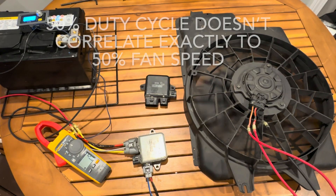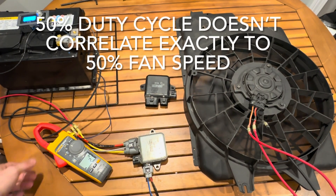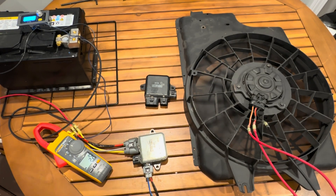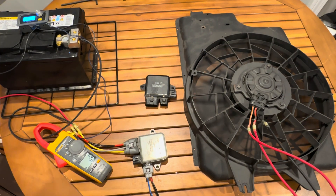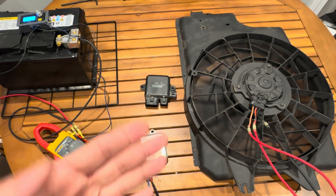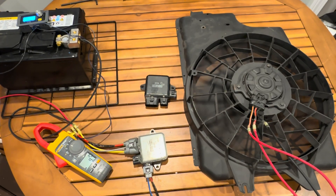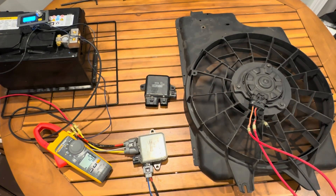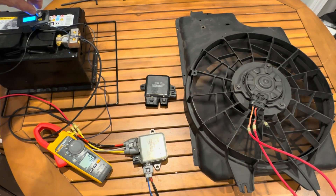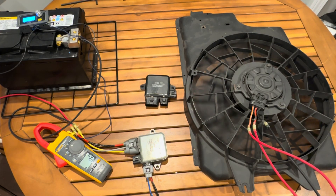As we go beyond 20%, we're drawing about half an amp — that's the lowest possible speed. I'm going to run it up to 50%. You can see the fan slowly increases speed and the amps climb to around 2 amps, stabilizing at about 2.2. Now running up to 100% — we're climbing to around 10 amps with quite a bit of fan wash. Even at full speed this fan only pulls 10 amps. Dropping back to 75%, the fan slows down to around 6 amps. At 25-30% we're pulling right around 1 amp.